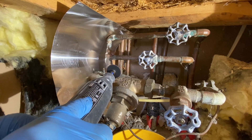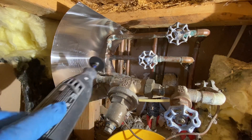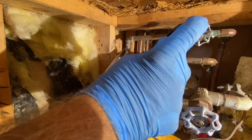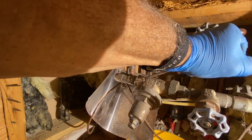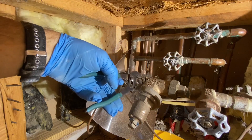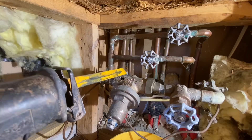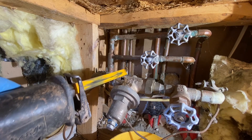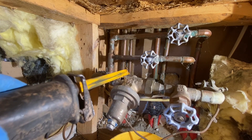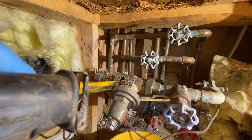This is how I cut the little hole Renee was talking about. I cut that hole in there so I could actually see where the male adapter is that the PRV is attached to, because we definitely do not want to cut the threads on that adapter. Now we're going to reach in here with a good sharp metal-cutting sawzall blade.